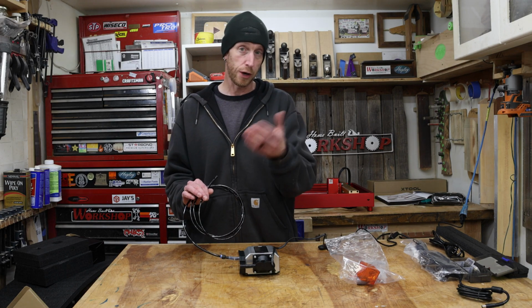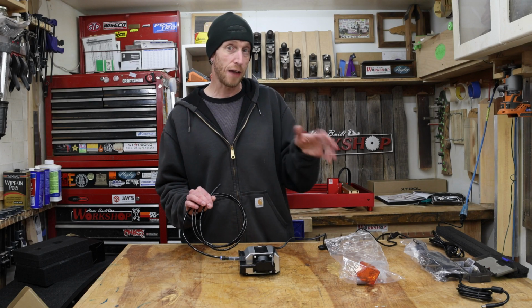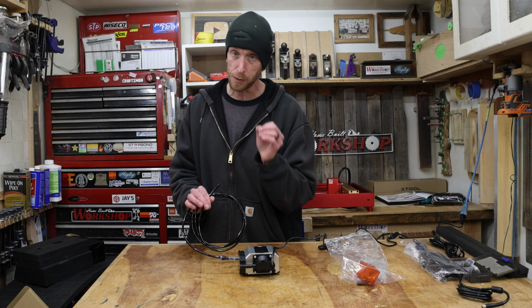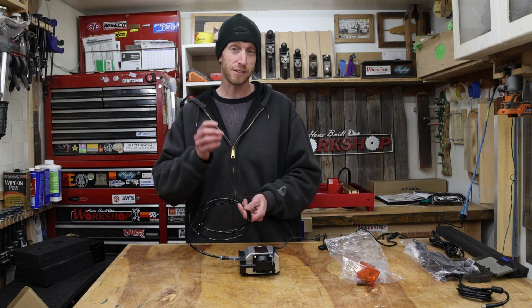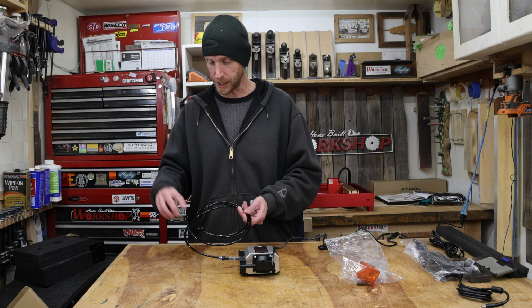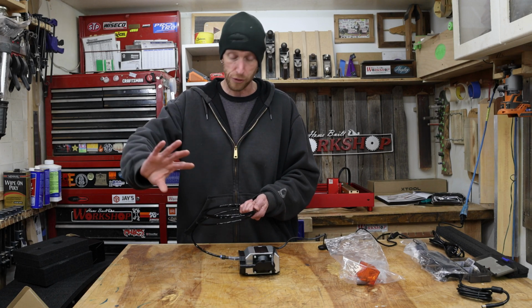When you're cutting or engraving wood especially, you can get some smoke staining on the product, and there are some different tricks and techniques that you can do to help eliminate or at least reduce that. But having an air assist is a big part of helping to reduce that smoke staining and those burn marks.